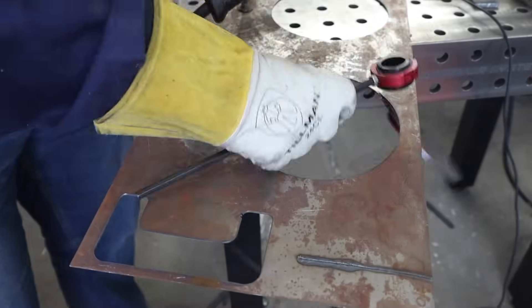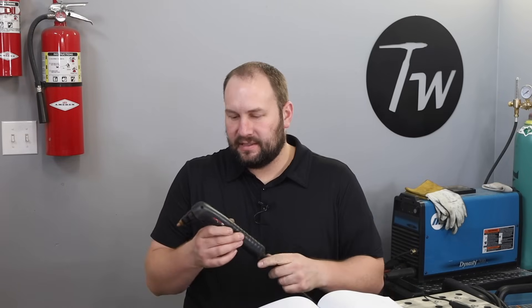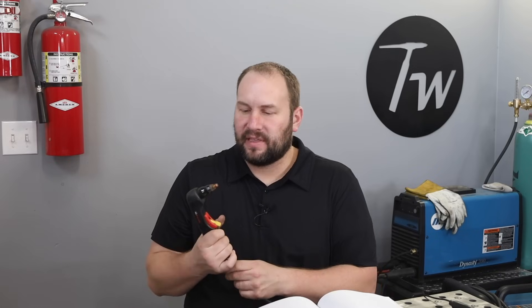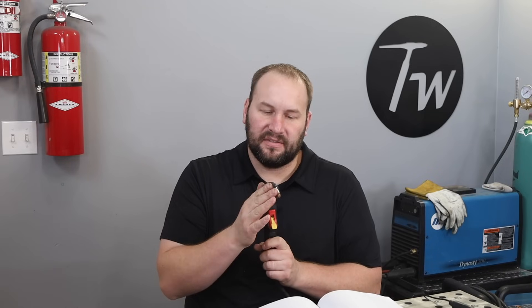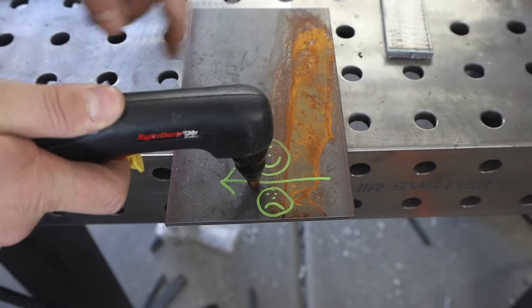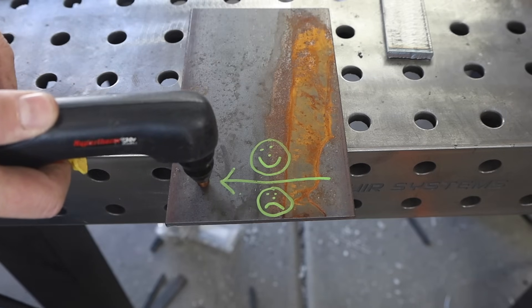One thing a lot of people don't know is that the air inside these guns actually swirls around, and part of the reason is to give a straighter cut — but you get a straighter cut more on one side of the arc than the other. On Hypertherm machines, and I believe most machines, the straighter side is the right side. So if you imagine you are the torch walking forward in the direction you're cutting, the right side will be a straighter cut than the left. Those are the basics of plasma cutting — hopefully you can get out there and make some nice cuts. Let me know in the comments if you have questions, hit that thumbs up if you liked the video, and we'll see you next time.